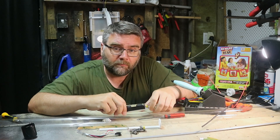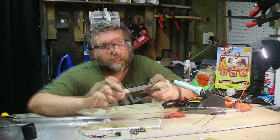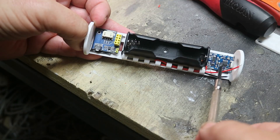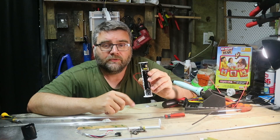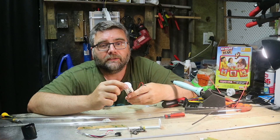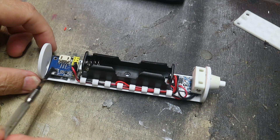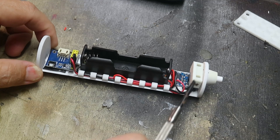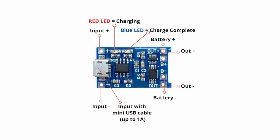I've already done part of this assembly. It's pretty straightforward — just attaching the boards and the battery holder to the circuit. Down one end there's a big hole where you put the LiPo charging board; in the middle you put your battery holder; and in the other end there's the circuit board which holds the ESP-01 and where you plug the LED lights in. There's a little hole on the end for the wire to come out. As far as wiring, it's pretty straightforward — you've got two wires, positive and negative, coming out of the driver board, which you feed down into the charging unit. There's battery plus, battery minus, out plus and out minus on there.